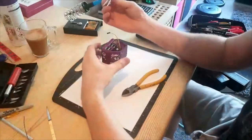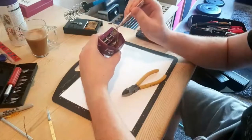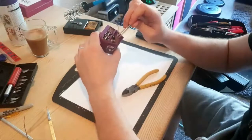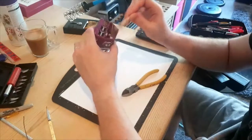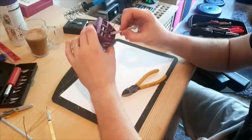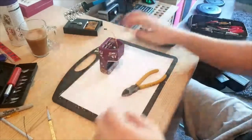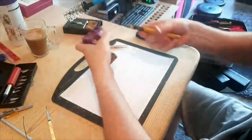You won't be able to see very well, but inside that switch, this is now connected to this little DuPont cable here. And I have a blob of what looks like hot glue on here, holding a solder joint. I don't know how I can call myself anything, even on an amateur level, that's bad. So what I'm going to do is get rid of all of this by cutting here, here, here, twining them together, a little drop of solder, that should complete the ground circuit. So how close can I get this? Again, because I don't want to snap all of this off.